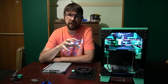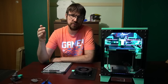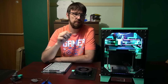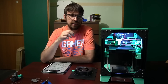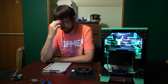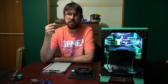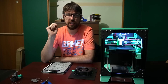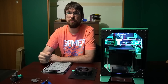I'm very happy with the Z — it's really stable and lends itself very well to fast 3D printing. The cost for this printer is around $450 USD, in line with other printers of this size. I have been running this at 30,000 acceleration doing testing, and I've run it at 20,000 acceleration at 300 millimeters per second. It's performing very very well — I'm very curious to see what other people will do with this printer.